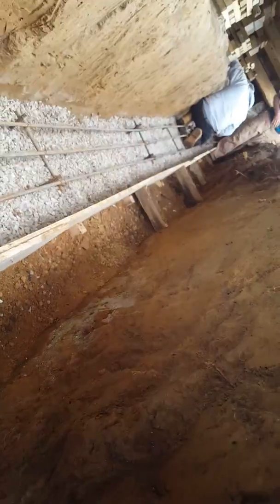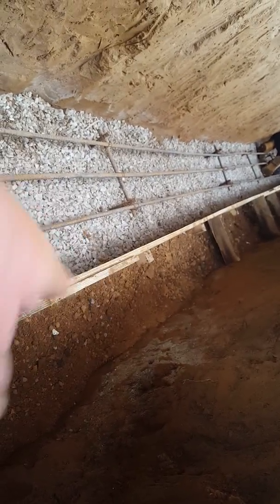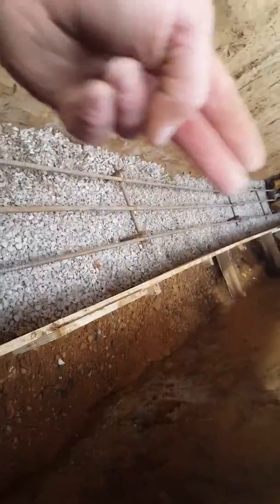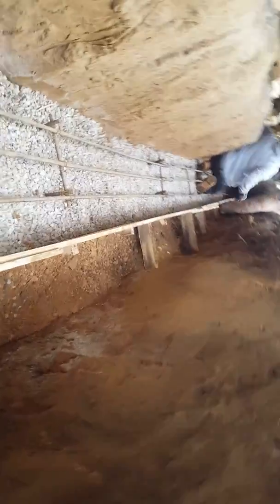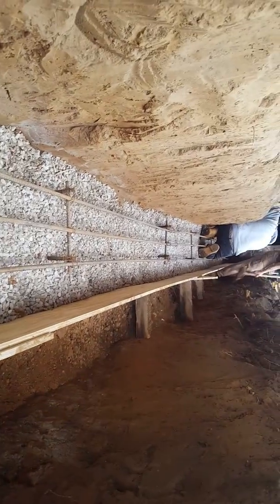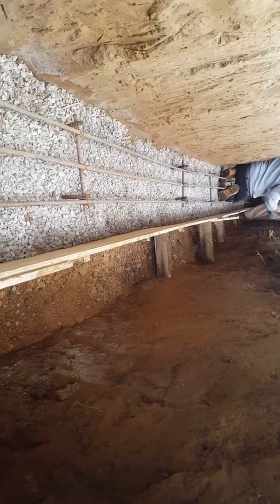And then they're taking a little bit of the dirt that is left over from the excavation, and they're just backfilling 1 inch or 2. What this will do is help equalize the pressure on the bottom. This concrete's probably 100 pounds per linear foot of force that's resting exterior. That's why we have all this bracing like this every 4 or 5 feet wherever it didn't seem right. So we have that all the way down, and that's pretty much how we did this footer. There are other ways to do it. This is the way I did it.